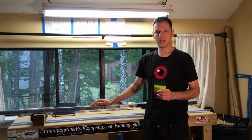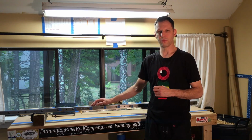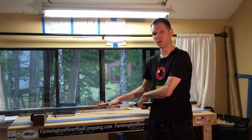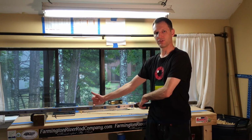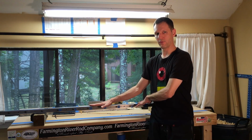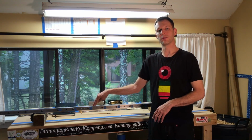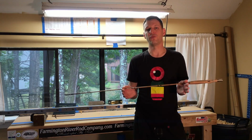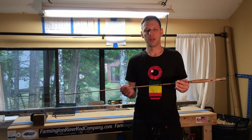A standard, typical method of creating tapers is to measure at 5-inch intervals. So this planing form has its adjustments or stations every 5 inches, and that's where I take those measurements, and that's how I set the planing form. Probably the most critical tool in rod building. There are lots of classic proven rod tapers. That's what most rod builders base their tapers off of.